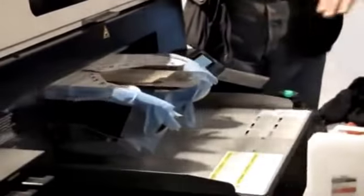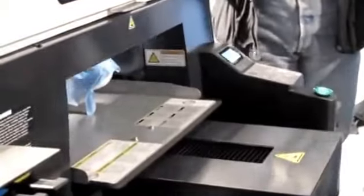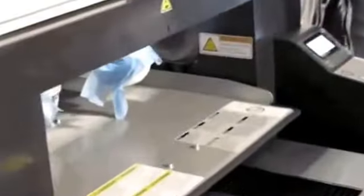So now the plates are new inside, if all of you want to come in and see what's happening inside of the machine. On the left side you will see a carriage — on this carriage the printheads are installed, each printhead is for one color. Now we are only printing CMYK: cyan, magenta, yellow, and black, and it's directly printed on the shoe.